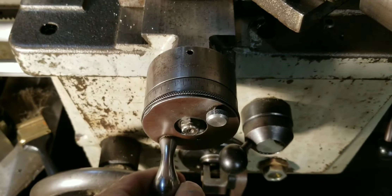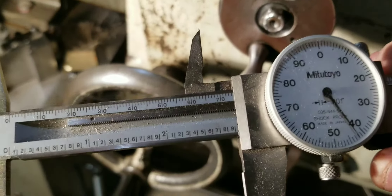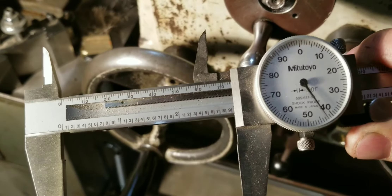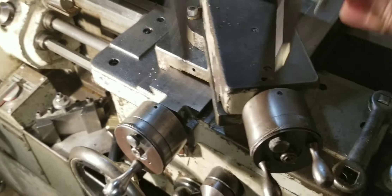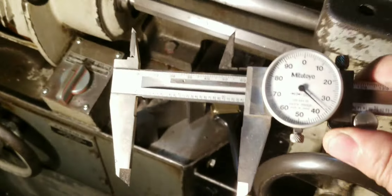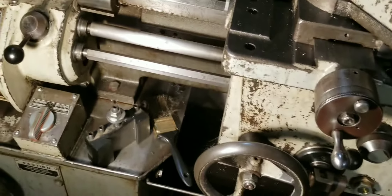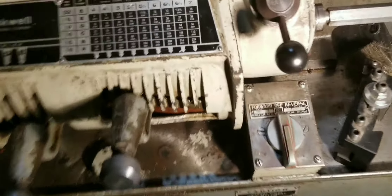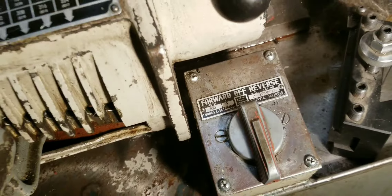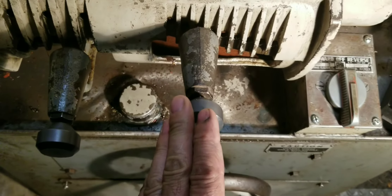If the handle is missing, honestly just make whatever you want. It looks like about two-point-nine-three-seven-five inches, so fifteen-sixteenths would be about the size of it. The other one is two-and-seven-sixteenths. And there's what the original knob looked like on the switch, in case that happens to be missing — mine was missing and I had to recreate some knobs, though I didn't copy anything, just made knobs that work.